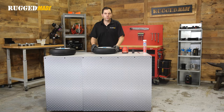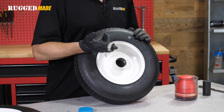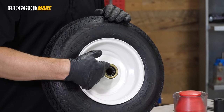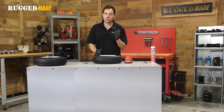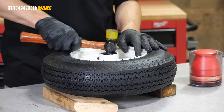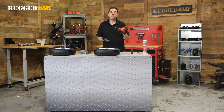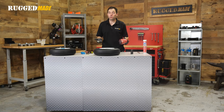Let's start by getting our wheels ready. These come with dual taper roller bearings in each wheel. They do come greased from the factory, but it doesn't hurt to put some more grease in. If you're going to be towing the splitter at all, it's a good idea to pack some grease into the hubs. The inside of each rim has a seal, and we're going to push that out carefully from the inside — a 27 millimeter socket is just the right size to gently push on the inner bearing. If you're towing your splitter much, this is something you should be doing on an annual basis anyway.